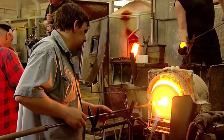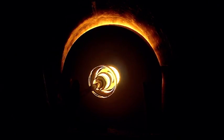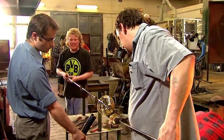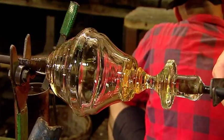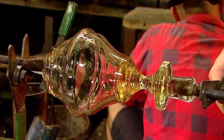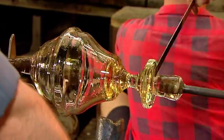A small spinning furnace, which the glassmakers call a trommel, can be used to affix the stem to a table bowl. It is also used for other special operations. The neck of a bottle, the spout of a carafe, or a pitcher are all made here.